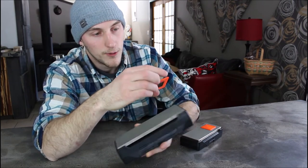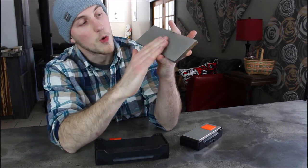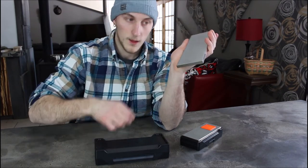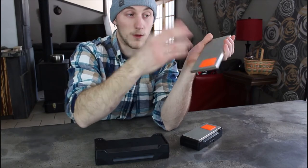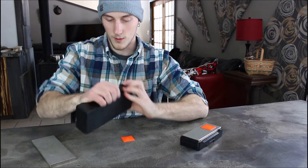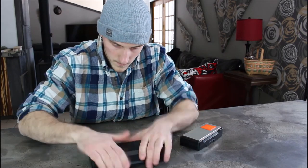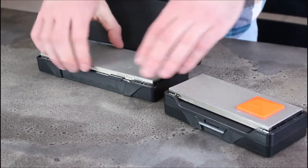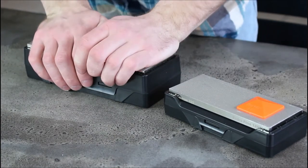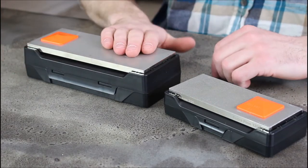So they've got 14 degrees, 17 degrees, 25 degrees, and 20 degrees. It comes in two different grits. One side is very coarse — that's 325 grit — that's what you use for reprofiling the edge. And the other side is almost completely flat, that's your 1200 grit. The beveling device can be magnetically attached to either side, which I think is pretty cool. And each stone comes with this stand, which is pretty awesome honestly. You open it right up, slap this down, put this in here, and you're all set.